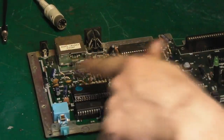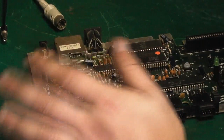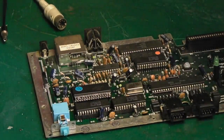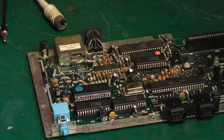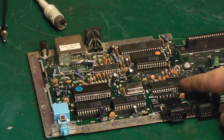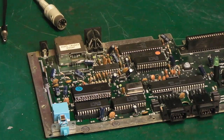But I was really thinking it was going to be in this area here, so it proves that what initially you see on screen doesn't necessarily mean what you're going to find. Like I said, I was pretty sure it was going to be that or the video RAM. We proved that out in the first video, and we've now proved that is not the issue. So I'm going to leave it there for now. In the next video we will swap that out and possibly that video IC there. And hopefully, fingers crossed, that's going to cure it. So at least it wasn't a quick, simple, easy fix. It is something a little bit more involved in head scratching.